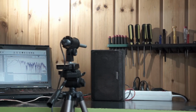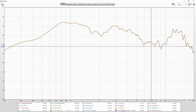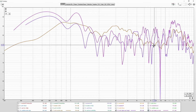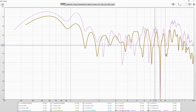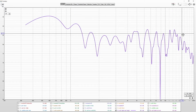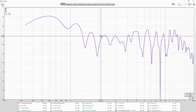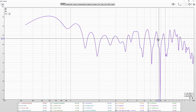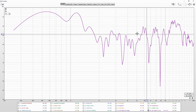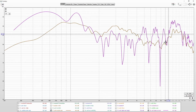Last measurements I took with Unit 1 being on the table, and the mic higher pointing down, and also the mic at the tweeter level. These are unsmoothed results, and because now there are all the reflections coming from the table and the walls, the response looks like that. But if you just eyeball the overall trend of the peaks, it seems to be flatter. So when early reflections are added to the sound, that 7 kHz dip is no longer here. So better not at this point to correct anything that maybe isn't there in the final results.